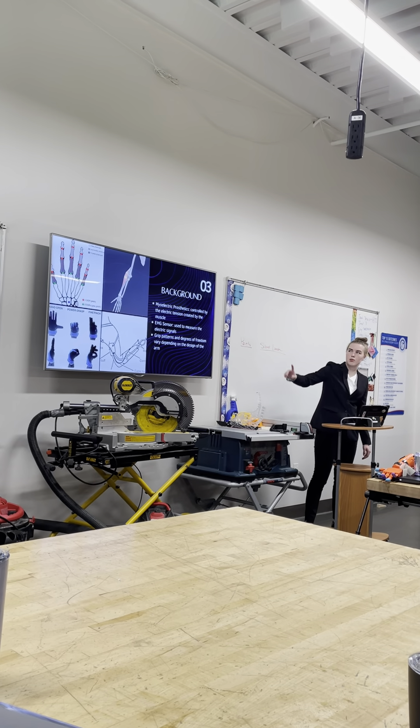I decided not to add an extra motor for wrist movement because the same type of motion can be produced by just turning the arm, and I didn't have time to add the motor with all the other tasks. I originally planned on using braided fishing line for finger movement, but ended up going with regular fishing line because the motor force wasn't enough to tension the braided line. Also, the diameter of regular fishing line is smaller, so it fit in the fingers better and allows the fingers to close more fully.